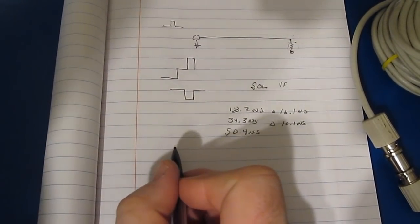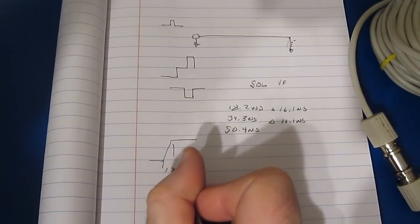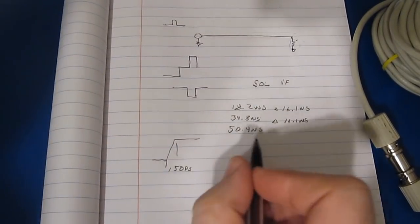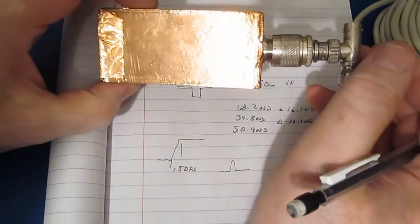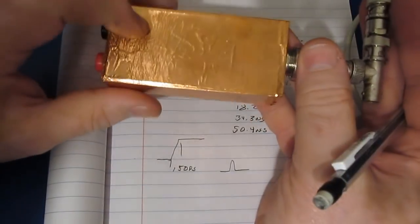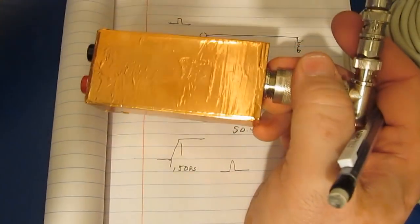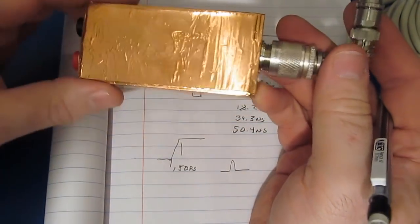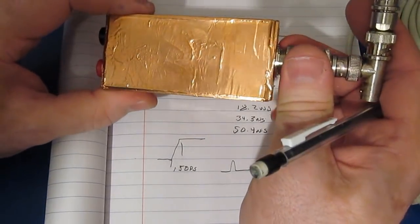The problem with the pulser coming off the oscilloscope is that while the edge rate is very fast — slewing in roughly 150 picoseconds — what we really want is a pulse. The way we're going to do that is with this homemade pulse generator, which is nothing more than a couple of caps, resistors, a high-voltage power supply, and a transistor. Fairly easy to build — you could probably make one with just junk from your drawer. I think I used a 3904 or maybe a 2N2222 — nothing special, just a jelly bean transistor.